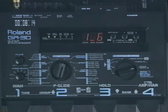Now, I have my MIDI out connected to MIDI in on the other machine. This unit is ready to receive system exclusive data at any time, so I don't even have to touch this. But over here, I simply press edit play and it shows sending. The other unit displays exclusive ECL, showing us that we are in fact receiving data. And that takes a few seconds. And then finally you see end is displayed on the source machine. The slave machine is now ready to play.